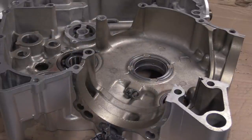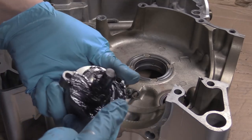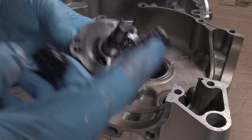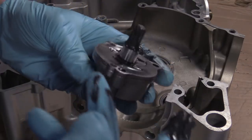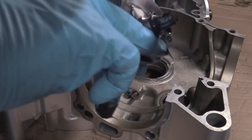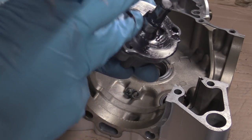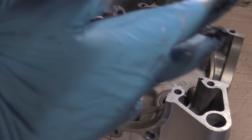And then, with another glove, with another lovely glove, this is actually a second hand glove, the best that money can buy, just wipe off this shit and just try and make sure it covers the holes. The reason why is one of these holes is an intake and one of them's an output. I don't want to get all this grease, in a sense, trapped between the surfaces.